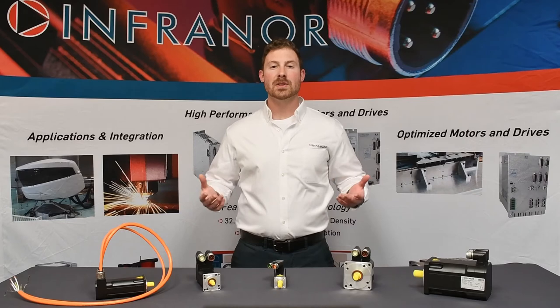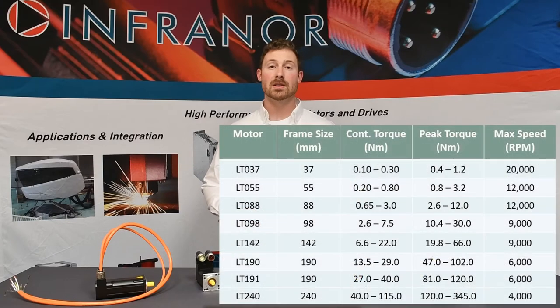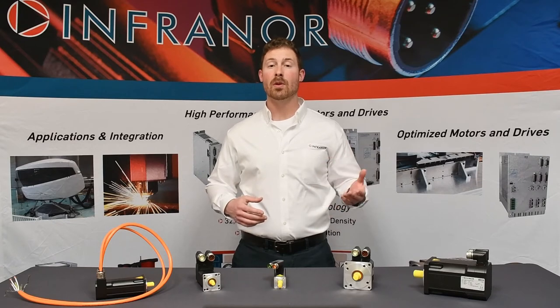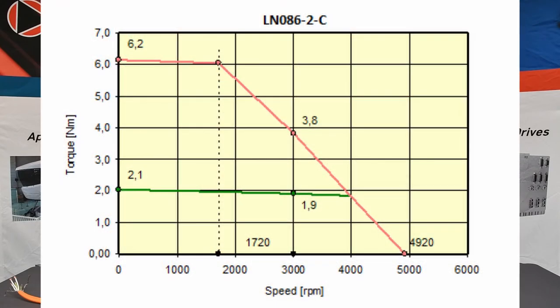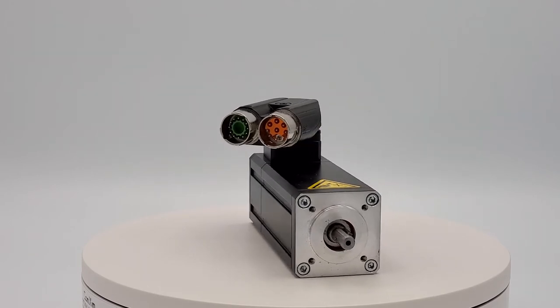The continuous torque ranges from 0.28 to 60 Nm for the LN series and from 0.1 to 115 Nm for the LT series. Peak torque is typically 3 to 4 times the continuous torque. For example, if you are more accustomed to speed versus torque curves, here is an LN86-2 motor's curve. Its stall torque is 2 Nm and peak torque starts around 6 Nm. Speeds up to 20,000 RPM can be obtained in the smaller frame sizes.